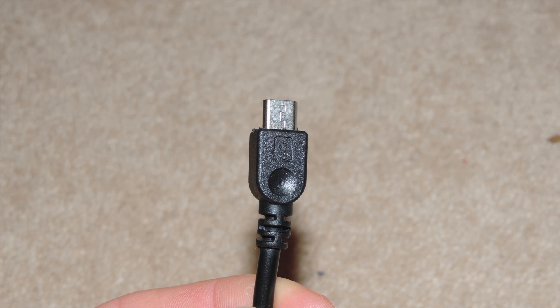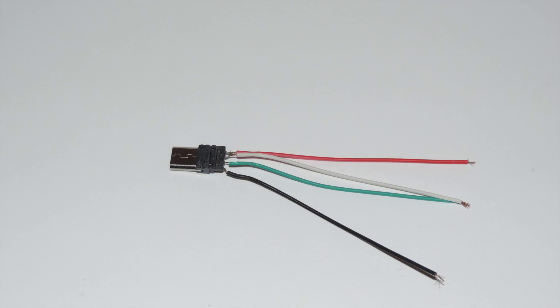So what I actually had to do is make my own cable. I cut up one of my many spare USB cables, only to find it has just four wires instead of five. The precise wire I needed is either not present in a standard USB cable, or is attached to ground — which would make it a USB OTG cable, the kind used for Android or tablet devices.